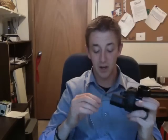So you've turned off the water, so now we're going to take apart the valve. He says disconnect the field wires. Probably a good idea, but it's not usually a step that I go through. If you just make sure that the wires don't get tangled up and so tight that they actually rip off the top of the solenoid, you'll be good to go to just actually unscrew the solenoid. Remember, lefty-loosey, righty-tighty. So just make sure that you drape the solenoid over the side of the valve box, but don't put the solenoid in any dirt or rock or get any junk on the bottom of that solenoid, because that'll give you an issue later.